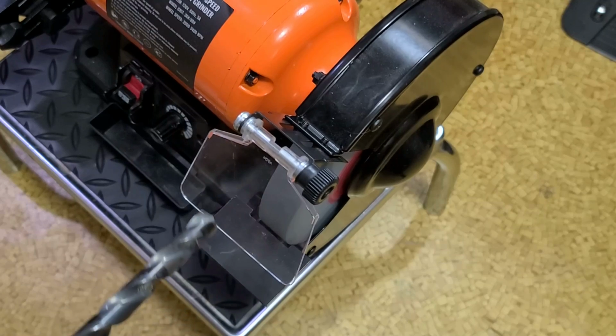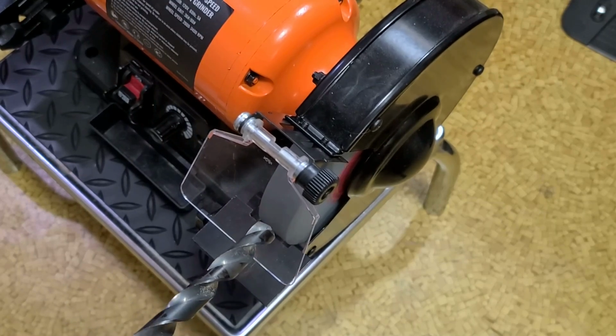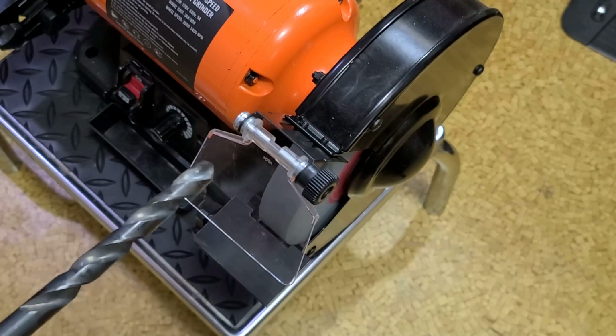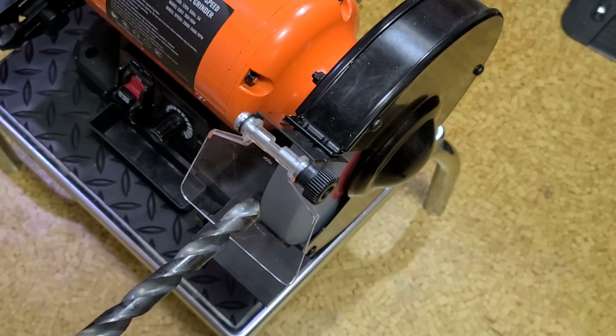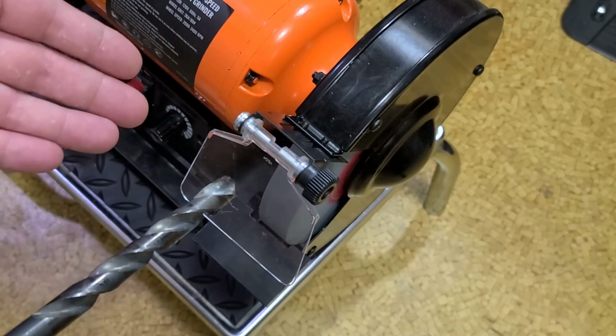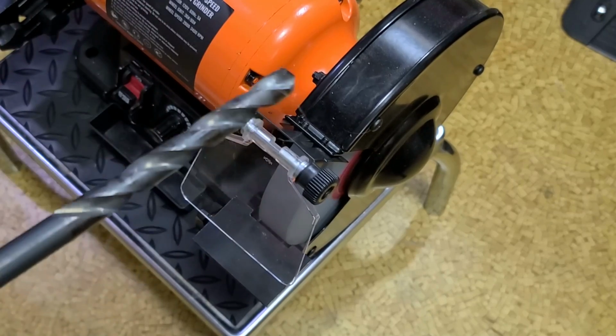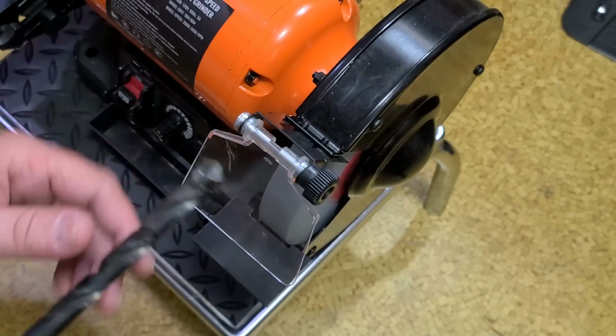When you're running at low speed, really cheap variable speed grinders, even my Delta does this, where you start grinding and it really slows down the wheel, so you kind of have to over-adjust it to go faster than what you really want, so that it slows down to the speed that you desire when you're actually applying load. So that's what's kind of nice, and I'll show you.